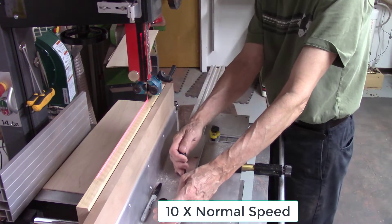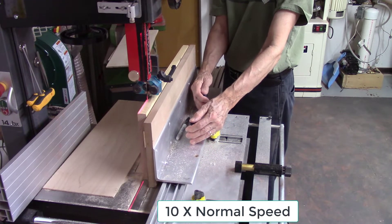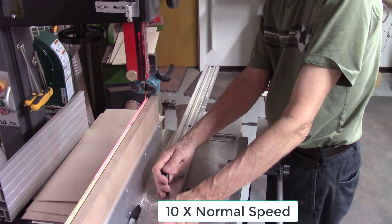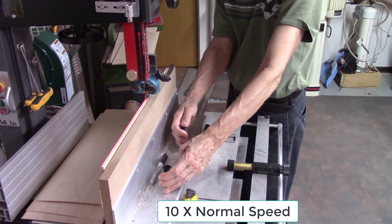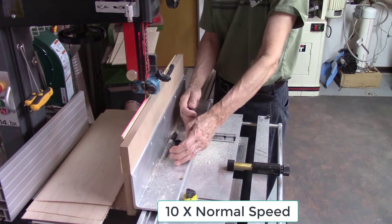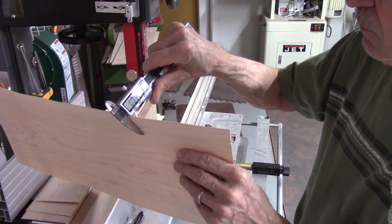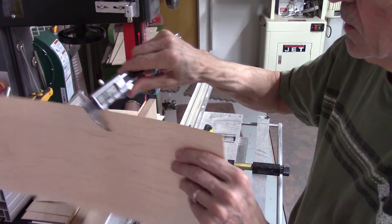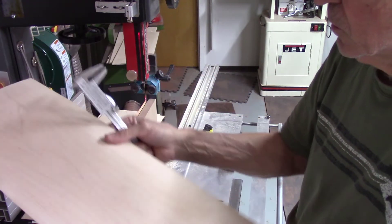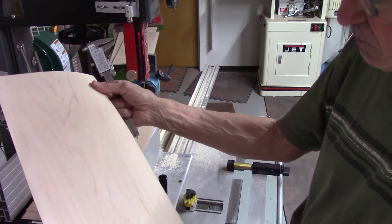I continued to slice 125 thousandths inch thick panels from the larger maple board. At the end I had some wood remaining, so as a final cut I sliced a panel 20 thousandths of an inch thick. This piece is eight and a quarter inches wide by 22 inches long by 20 thousandths of an inch thick. I set this to 20 thousandths coming off the bandsaw and it measures right around 19 thousandths — 18 thousandths on the other side. So about 19 thousandths, plus or minus two thousandths of an inch. Edge to edge, top to bottom, perfectly flat.